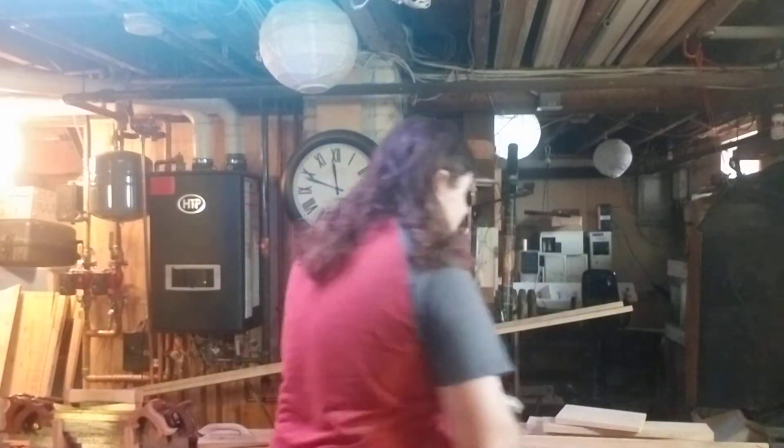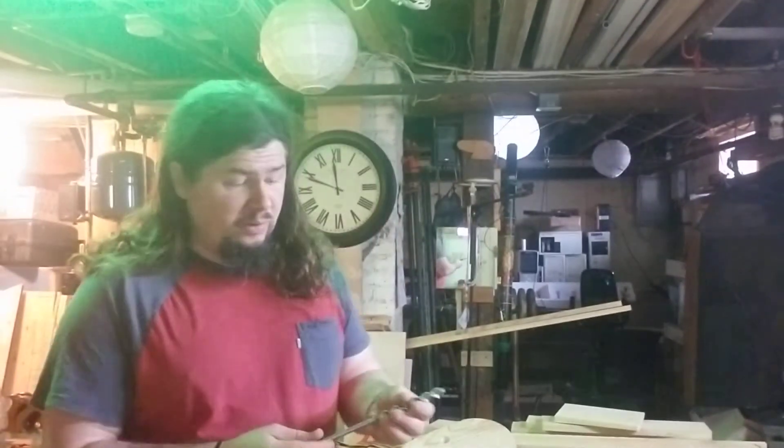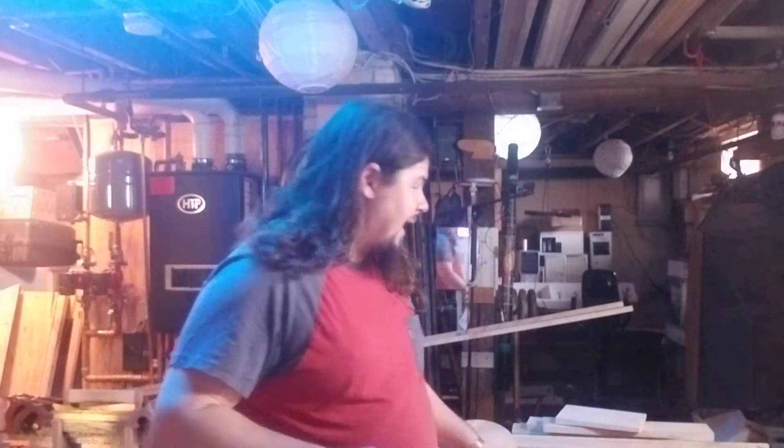You will need a drill bit, and you're going to be drilling big holes. The holes I drilled in that one I drilled with this 9/16th auger bit. Auger bits are a pleasure to use — they have interesting geometry: a lead screw that pulls the auger into the wood, spurs on the outside that score a circle, and a leading edge that peels each layer of wood off in a circle. You can get this one from Tools for Working Wood — it has a square shank for use in an old-style brace and bit. You can also get excellent ones from Wood Owl with a hex shank for use on a modern power drill, and Lee Valley sells a three-jaw chuck hand auger that would work with those.